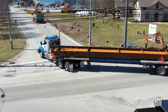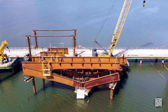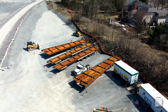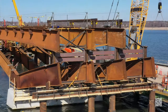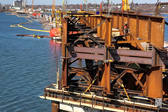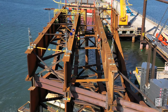A steady stream of beams arrive throughout late winter and early spring. The whole structure grows steadily, and in early April, beams linking the two existing sections are installed, and their successors wait patiently in the lay down. On the north side of the lay down, the yellow platforms known as angel wings have also arrived in Kingston. Struts and cross braces are positioned immediately following every installation. The blue buckets you see contain engineered bolts, and the largest joint on the bridge has 304.